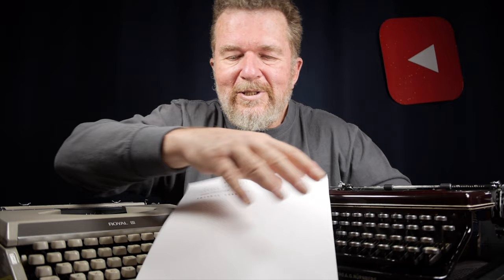So it's hard to predict — if you went out and bought a machine, you wouldn't be able to tell ahead of time whether it would really do this. But I invite you to bring some typewriters out and try the double strike effect. You can tell without even typing by just pushing the space bar, watching the carriage, and seeing how much it moves on the press versus the release. It's an interesting idea — maybe an unofficial, ad hoc spacing category that has to do with how your machine is lined up.